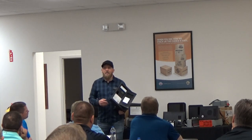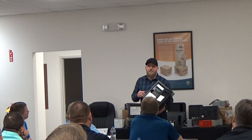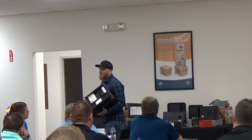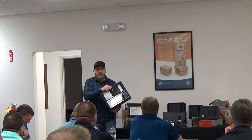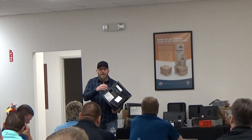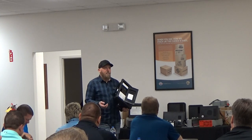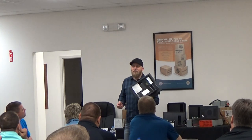It won't trip them every time. Some are more sensitive than others, so on and so forth. But every converter on the market, just by the way these operate, does have the potential of tripping the GFCI. So that's going to be one thing you hear all the time. And you can tell them they can replace this, and the next one they get, it's probably going to do the same thing if it's that certain GFI. It might not. So switching out the converters because it's tripping on the GFCI is not going to fix the problem, because the potential is always going to exist.